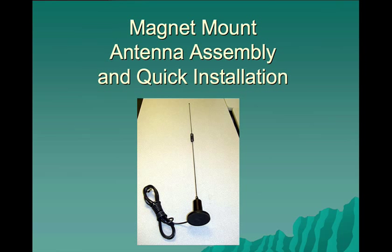The reason why we went with an additional magnetic mount antenna was to help us get on the air more quickly. We felt that if a base antenna needs to go up on the roof of a shelter or in an area that would require a ladder or special access, and we need to get on the air quickly, we use a magnetic antenna. We'll provide you with some suggestions in a moment about how to mount that antenna.